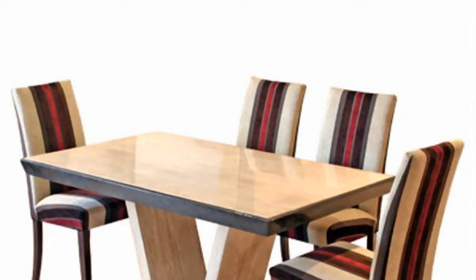Measure the length and width of the furniture frame area you will be covering with a measuring tape. The sheet cane should be at least 2 inches bigger in length and width than the area to be covered. Place the cane sheet and spline in warm water for at least 15 minutes.